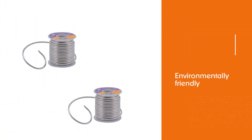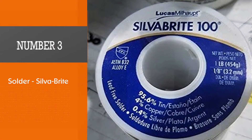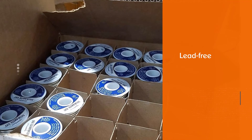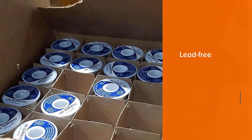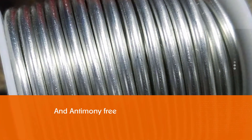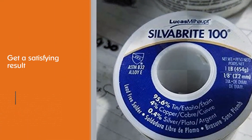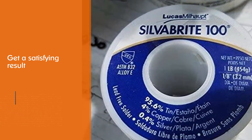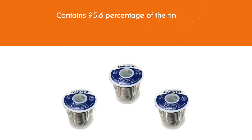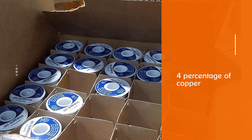Number three: Solder Silver Bright. This is one of the best solders for copper water lines because it is lead-free and antimony-free. You can use it for copper pipe sweating and get a satisfying result. It contains 95.6% tin, 4% copper, and 0.4% silver. The melting point is 440°F, one roll weighs one pound, and the wire size is 0.062 inches.